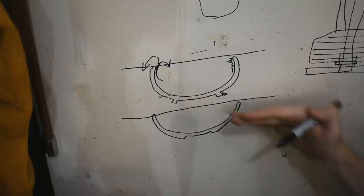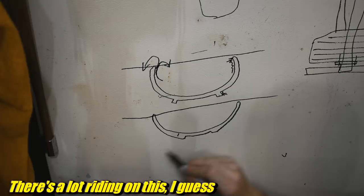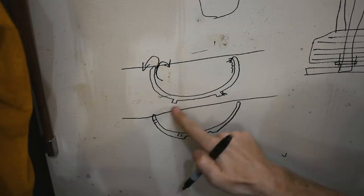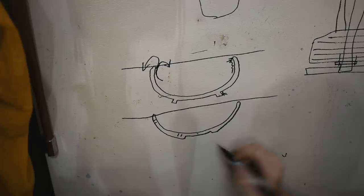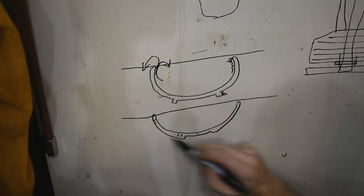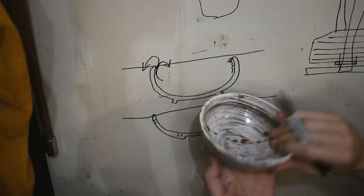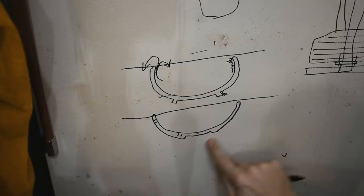However, we have a difference in thickness here — it's thinner here, thicker here, thinner here. I had to do that because of the undercut issue, and that means I'm going to have a slight casting problem that I'll have to solve with a feeder or something. I'm actually drawing these the shape of the bowl — I'm going to be casting it upside down, be aware of that. You can get away with more thickness variation in clay than in metal casting, unless of course you add feeders and that kind of thing to your gating system.